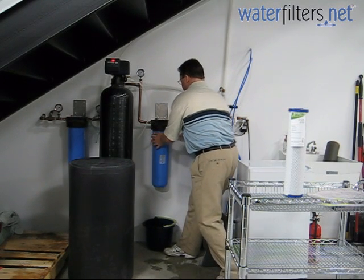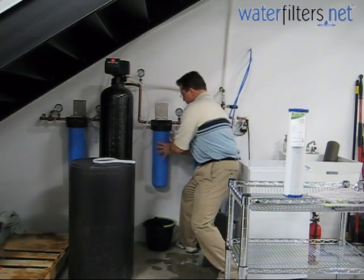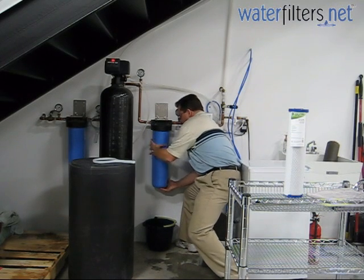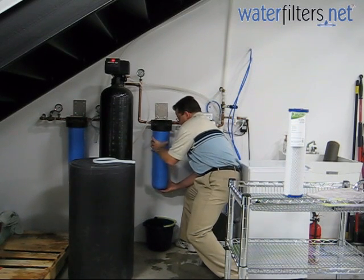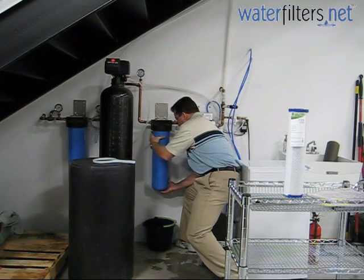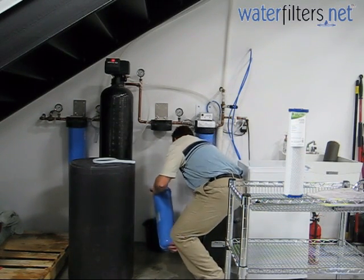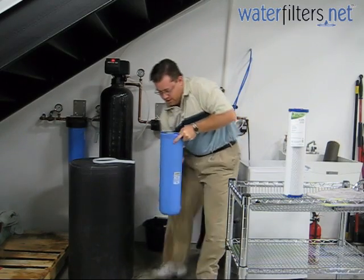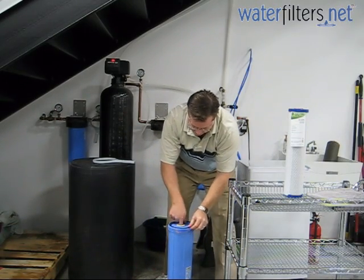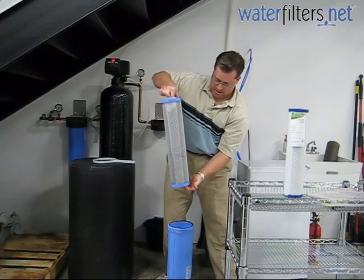Slide the filter wrench up on and it's loose enough now that I don't need the wrench anymore, and I'm going to loosen the filter housing. This is the sump that I'm removing from the cap. In a few turns it's going to fall out into my hands and get me wet. Don't wear your good clothes when doing this project. A little more water and there it is. Dump the water into my bucket. There is our filter sump and here is our used and well-used carbon block that we're replacing.